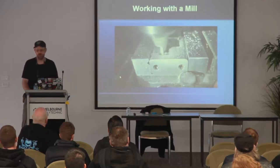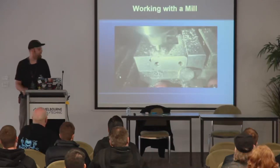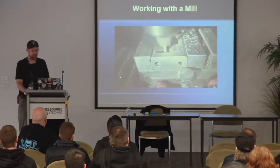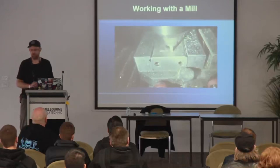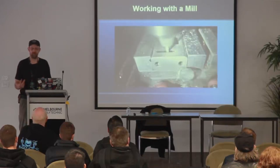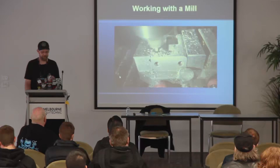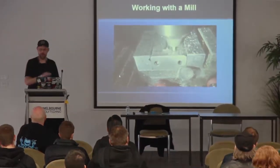About a 2% failure rate — isn't much to complain about. I've been asked before why I don't use cutting oil while I'm doing it. I find all it does — especially with this style lock, most brass and aluminum — you don't need oil. All it does is gum up everything and make cleanup harder and make what you're doing harder. You can see there I dropped the head of the mill for a little bit when I was doing my cuts across — it wasn't quite cutting enough.